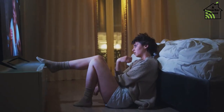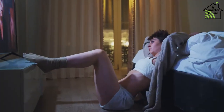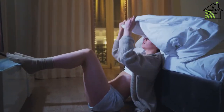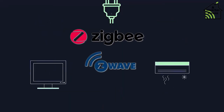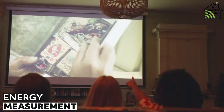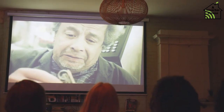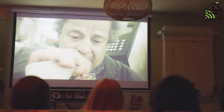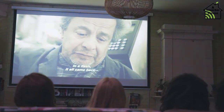A lot of people also have a TV in their bedroom. How annoying is it when the sun shines on the TV? Have the IKEA blinds automatically go down and dim the lights when you turn your TV on. This can easily be done with a Zigbee or Z-Wave socket with energy measurement. For example, if the TV socket uses more than 15 watts when the TV is on, the blinds go down. When usage drops to 0 watts, the TV is off and the blinds go back up.